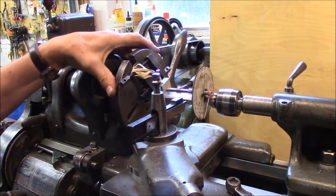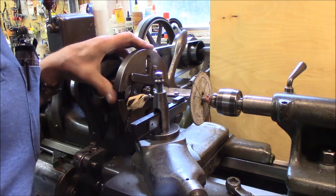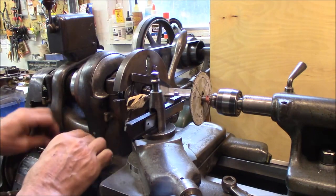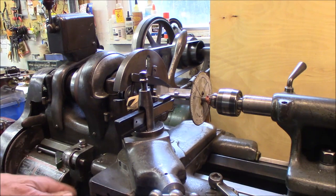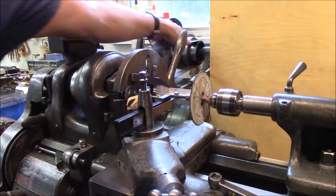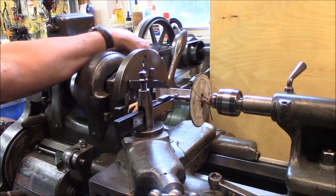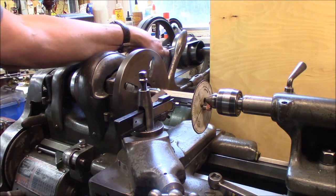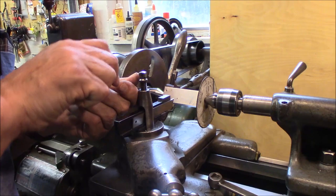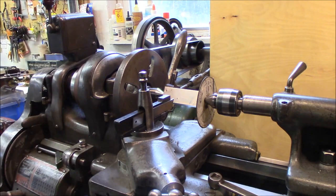You move in the amount of lift — I think in the article it's 0.065 inches on the lift — so you move in and make one cut. We'll start on the left side, closest to the headstock. Before you turn anything on, rotate it all the way around and make sure you're not going to clobber anything, because this flops around in there. Make sure everything's tight. Wear your safety goggles — absolutely wear your safety goggles on this one.